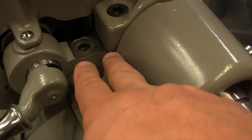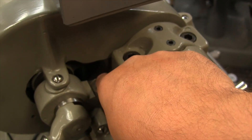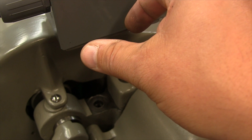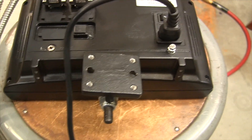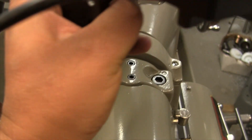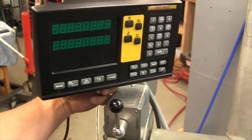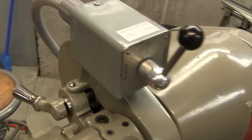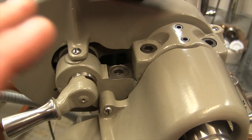The idea I came up with was to have a piece of metal that comes out short — maybe two or three inches — just enough to clear the electrical switch. It'll bolt in there and then come up with a bit of a stem piece hooked to it, where I can attach the DRO unit. It'll make for a very compact design. Given the mounting hole that's just sitting there, I can use it, and it's less fabrication and fewer holes in the machine. That's the way we're going to go.